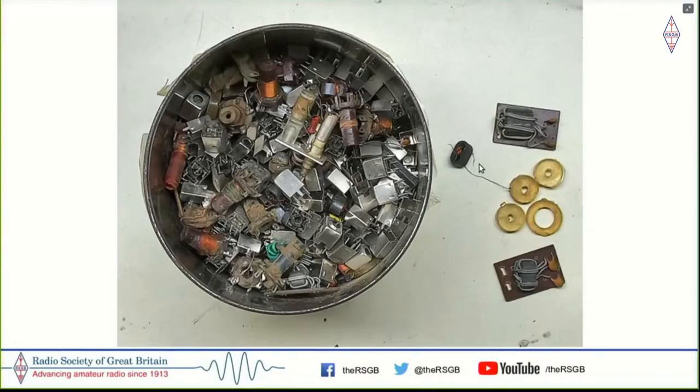As you can see, there are no toroids. I still have this box. But what I did have instead of toroids is what you see on the right hand here. These were sold for the terrestrial television, which was the only television we had here in those days. We had just one national channel, Doordarshan, and it used folded Yagi antennas on the top of our houses. And to convert that to 75 ohms, we had this double barrel kind of a thing, which took in balanced 300 ohms on one side and gave out 75 unbalanced on the other side.